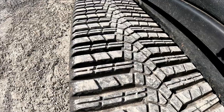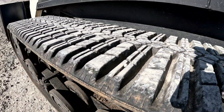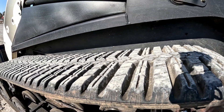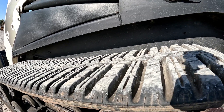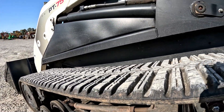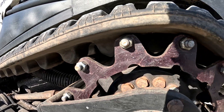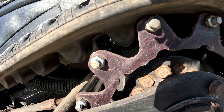The track on this side is really good — lots of tread depth there. This is a little bit different style tread pattern than we've ever had here, but I'm gonna say they're probably 80% or better just going off the tread depth. Lots of life left there in these, at least on this side. The squirrel cage is pretty good here — this is the ASV-style track obviously — squirrel cage looks pretty good.